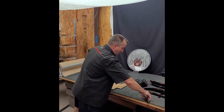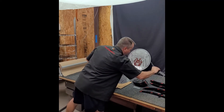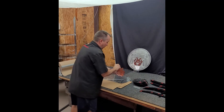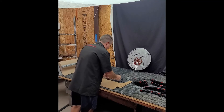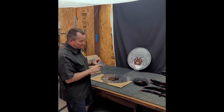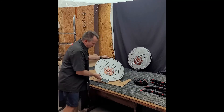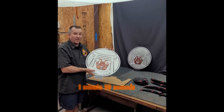So I drop it into my template, throw this across, and come in with my first sword — it's going to go across the bottom. I have my two reference marks that line up, place that there, come in with my second sword, get my two reference points, and place that down. Come in with my mask — a couple of years ago I got calibrated eyeballs put in, so for centering things up in the plasma world it makes it very easy. That goes on there. Then I come in with our custom laser engraved name plate — we use two-part plastics and our CO2 laser to make these in house. Set this and away you go. One knocked out — it goes very quick for doing a lot of these, and templates like this can really help you out.